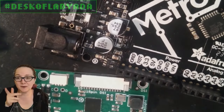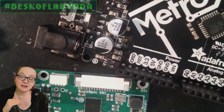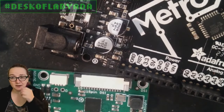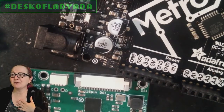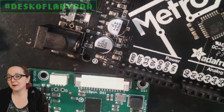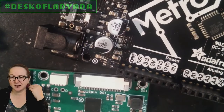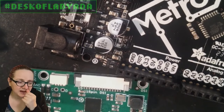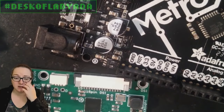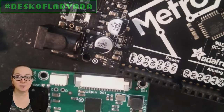And there's only one time I'll say that you should not use ceramics. There are some power supply chips that need high ESR for stability, because they use the series resistance of the capacitor to stabilize the feedback. I think the MIC5205, or I don't remember exactly the part number, but I tried making a power supply with an older chip, like an old 1117 or something. I tried building it on a PCB with ceramics. It actually wasn't stable, it was kind of oscillating. When I put on the same capacitance but electrolytic, it stabilized. So, you know, it happens.